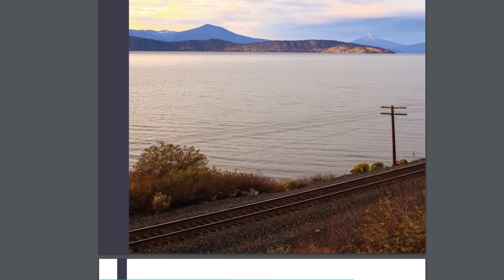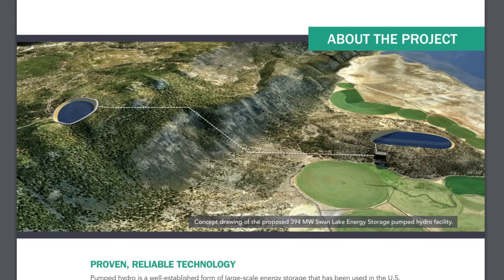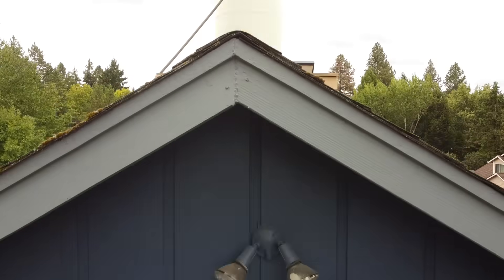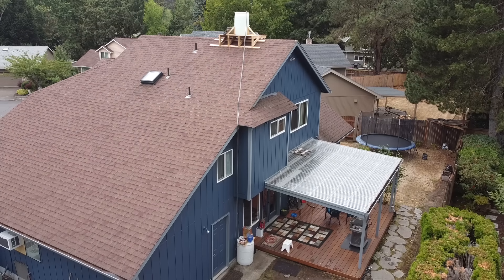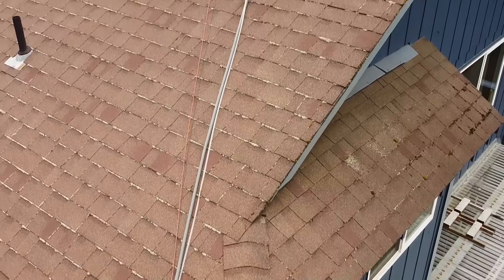That's something that renewables like solar and wind just can't offer until we come up with massive energy storage. Fortunately, there's already a pump storage project being built right in my home state of Oregon. When complete, the upper and lower reservoirs will each hold around 837 million gallons or 3.1 billion liters — the same as 15 million of my barrels — with 500 meters of height difference between them. That's literally a billion times more energy than the barrel on my roof.